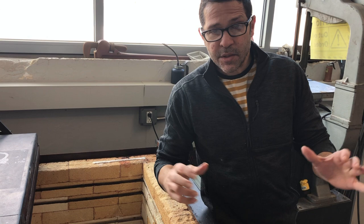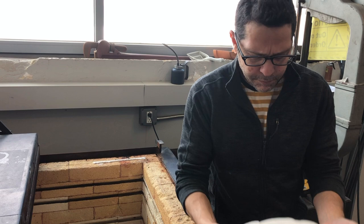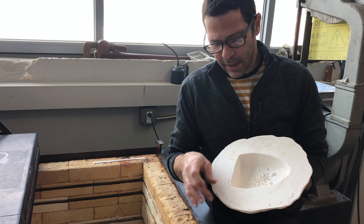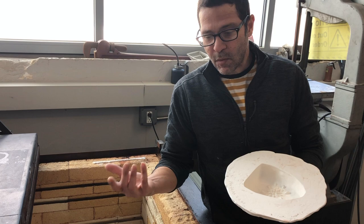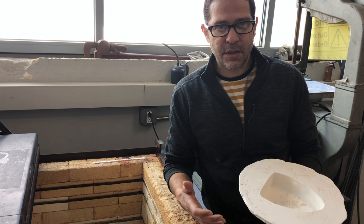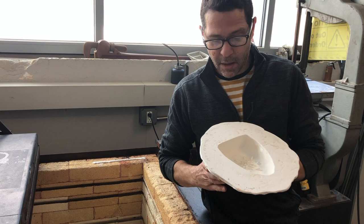Now let's talk about how to properly prepare your mold. The first thing is you need a properly built mold — the walls should be at their thinnest point at least one and a half to two inches wide. Any thinner than that with a plaster silica mold and you risk the mold cracking open and glass pouring out everywhere. The only workaround is to prop weak sides with fire bricks or jam them against other molds, but it's better to just build stronger molds with wider walls.